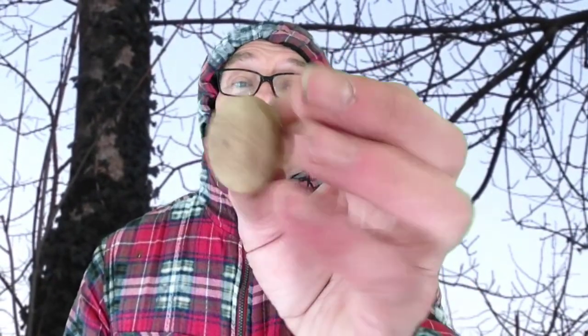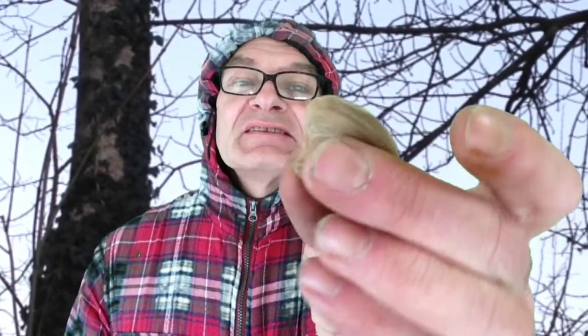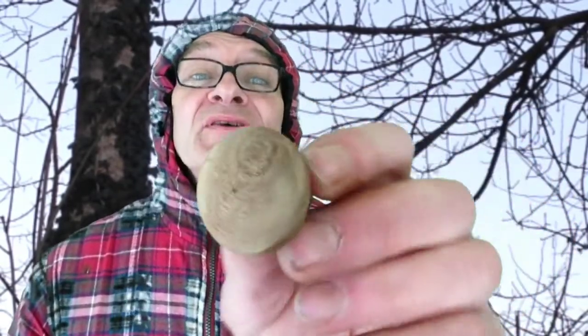And great, we've actually come up with a knob by the end of that. Here it is. You can see it's pretty much the same shape as I was after. Not identical, but it doesn't need to be. The point is, I can have a cup of tea now. I drilled it out using my pillar drill. Sorry I didn't get any footage of that, but it's really dark down there. But I got the right size drill bit to just cover the inside of the screw and not the thread so that they bite. And it screws in nicely like that.